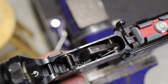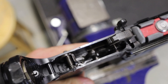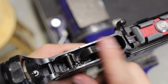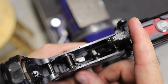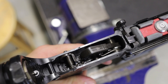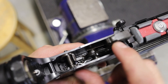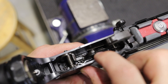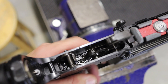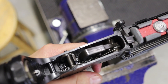Here you're looking at an M16A4 fire control group. You have your auto-sear, your hammer, selector, and the rest of the guts. In the semi-automatic position, it functions as a semi-automatic rifle should — pull the trigger, hammer releases, the trigger is still pulled, and the disconnector will arrest the hammer, ending its cycle. It's a little different than your conventional AR-15 trigger group: here you have two disconnectors — the semi-automatic disconnector on the left and your burst disconnector on the right. In the semi-automatic position, the semi-auto disconnector is free to move and will catch the hammer while the trigger is pulled after the round is fired.